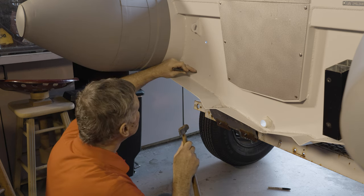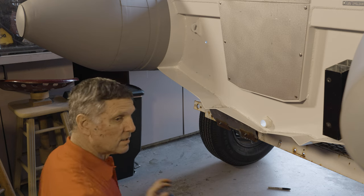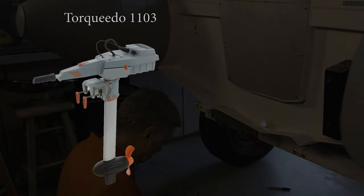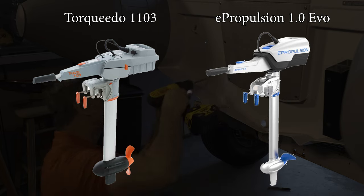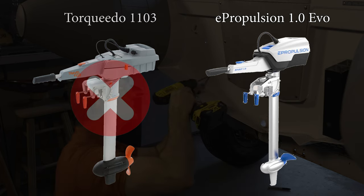Our other option was to find a light enough RIB that would work for both situations, where we could switch out the propulsion system quickly, converting it from a tender to a dinghy. We found two options for small electric outboards: the Torquedo 1103 and the E-Propulsion 1.0 Evo. Both were similar in power. However, the E-Propulsion model had two big advantages - you can power it from any 48-volt battery, whereas the Torquedo required its proprietary battery. The Evo model from E-Propulsion can also act as a hydro generator, and we plan to make use of that on the main boat. So we purchased the E-Propulsion Evo and the Stealth E18.